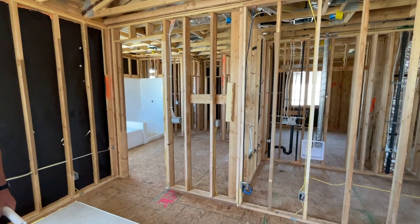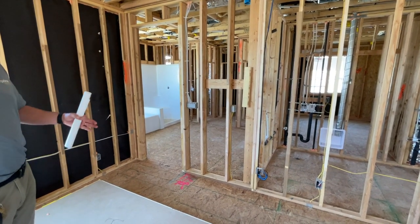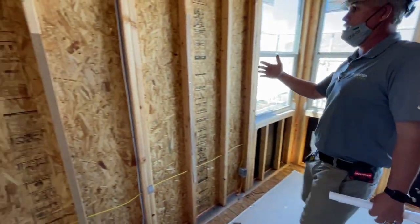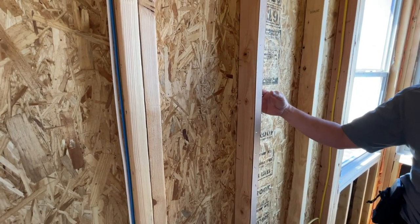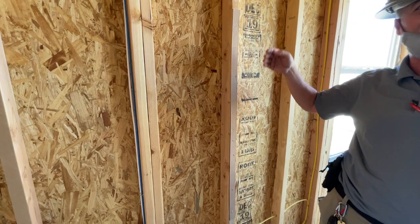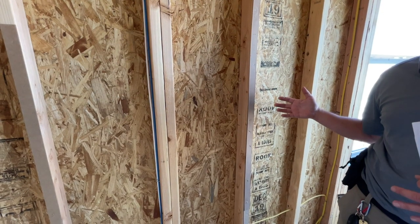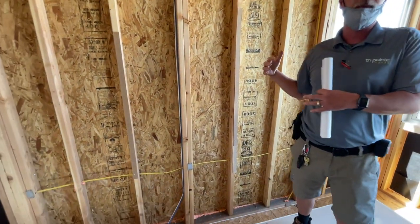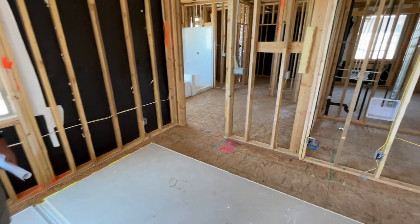How much do you think that adds in insulation? Like every R value is worth something, but you get to a point where if you have a 2x4 wall, your normal R13 will fill that void. Once you change it to a different product to make the same 3.5 inches two R value larger, it's still only a certain amount of space from the stucco to the inside of the house. You can only build that so solid to where it's really only going to make a difference when it's 125 degrees outside on that wall for 5 hours during the day, of whether it'll get a degree or two warmer inside the house. Makes sense. So probably not worth the money. No, I wouldn't think so.